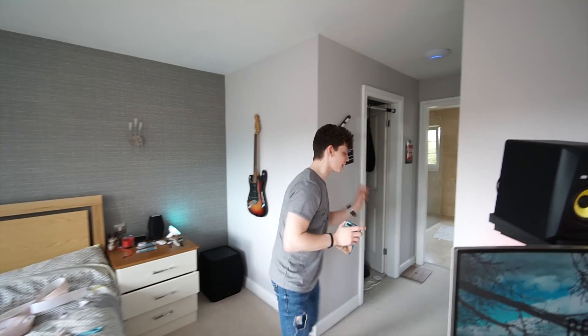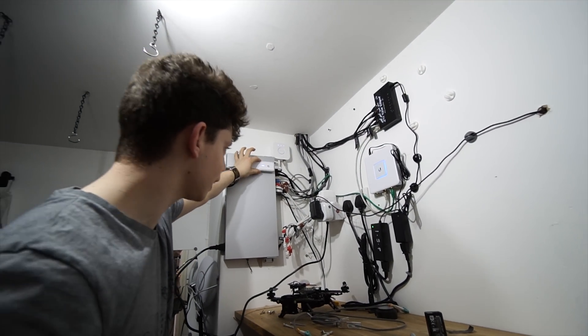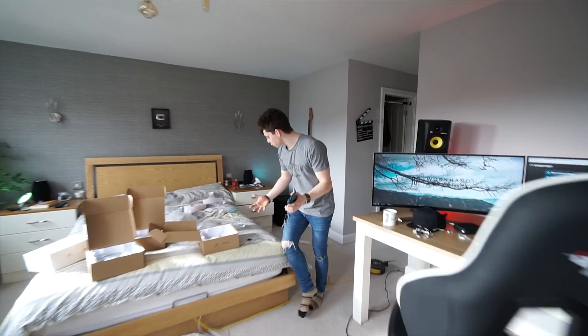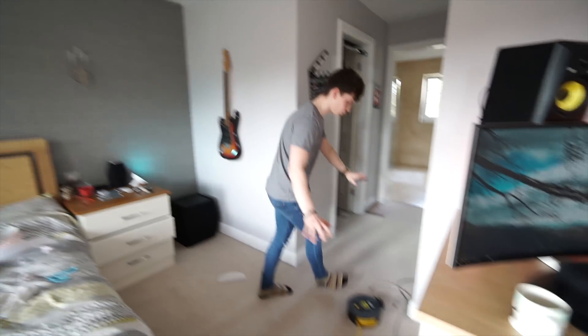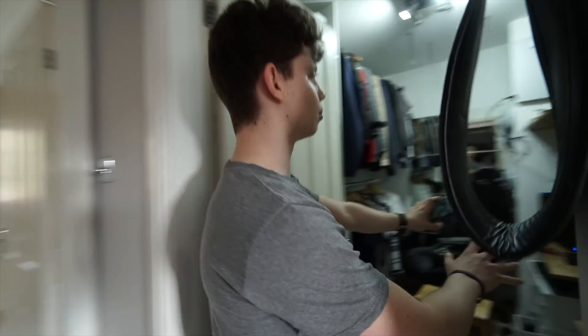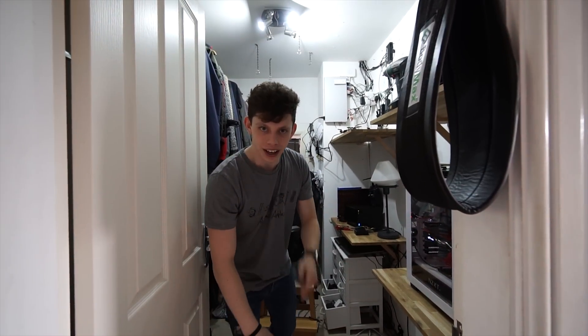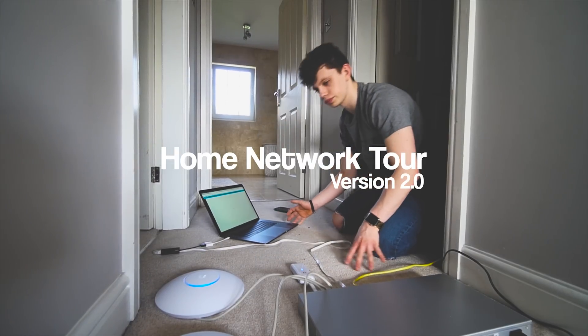Recap of what we've done: we took out the old router, replaced it with the USG. The USG goes to the 16-port switch. The 16-port switch powers the cloud key — which is like the console for everything — via power over ethernet, and then we've got three black cables going out to our three access points. One of the most overpowered networks a home needs has now been installed. If you guys want a dedicated network tour, drop a like on the video. My name's been Alex, this has been TechFlow — installing a Ubiquiti full-on network in a house. I'll see you in the next episode. Adios.